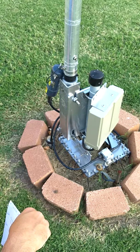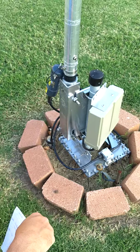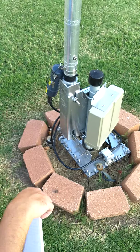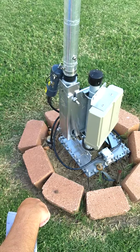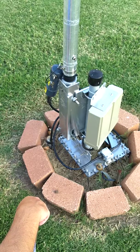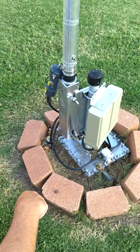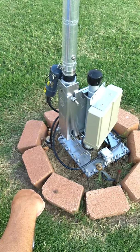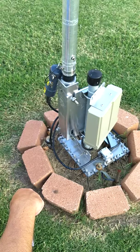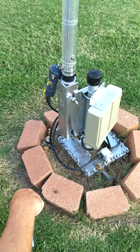And really, that's all there is to it. I've worked people all over the world with this. Sometimes in FT8 mode I'll turn the power down to 2 watts and work people all across the U.S. with just 2 watts in FT8. On 20 meters and 40 meters it works great; 80 meters maybe needs a little bit of help.